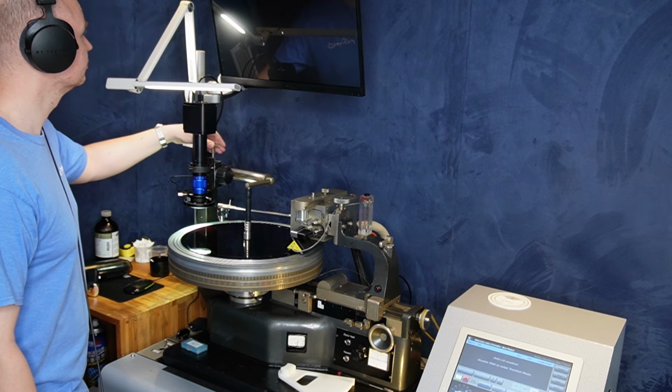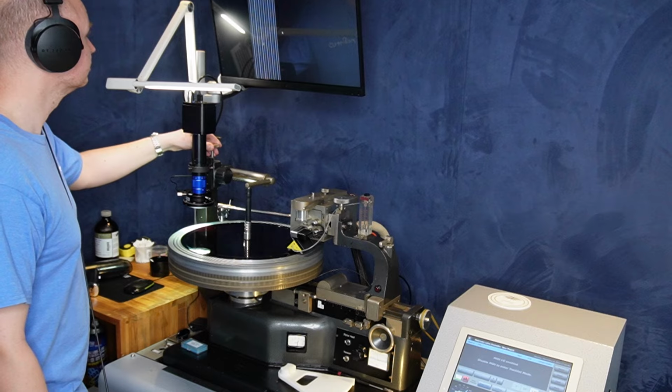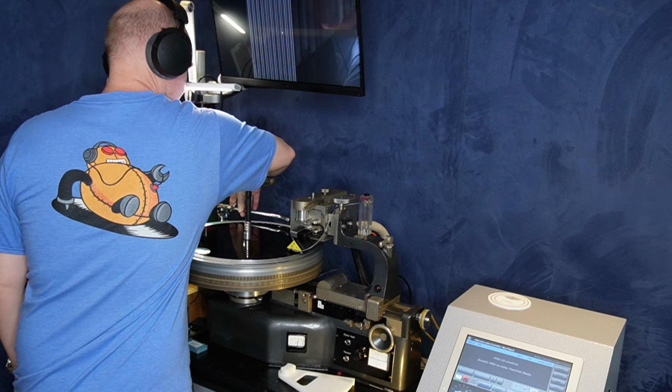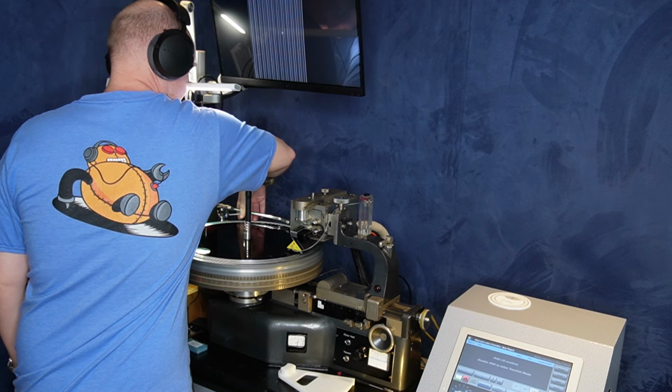I'm happy with this unmodulated silent groove, so I'm now going to play a louder section of the audio through the head, and I'm going to listen to the cut in real time from this pickup arm here. Playing back a lacquer is destructive, so we can only use this test area or an old blank to do this, and we can only do it once.